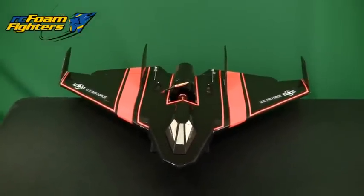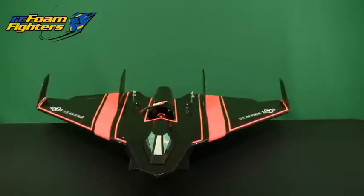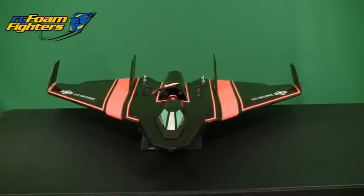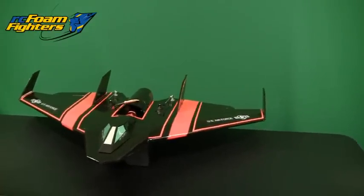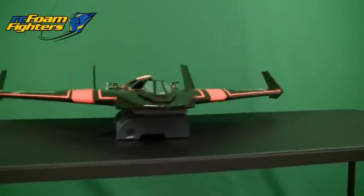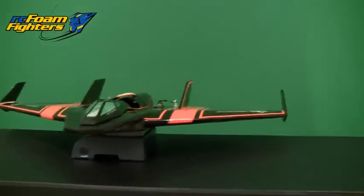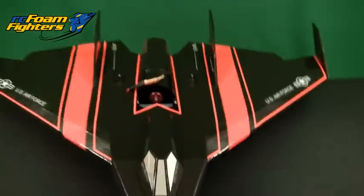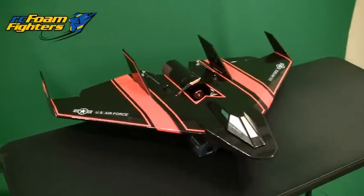Here's a look at the plane — I've got about 99% done. I've only got a few minor things to do: I just have to put the magnets on the canopy to hold it down. I may or may not put some landing gear on it, deciding on how I'm going to actually take off. I was actually pretty happy with the way it came out. I'm really happy with the way the wing and airfoil came out — it's got a nice shape to it, it's actually like a regular airfoil. I probably need to put one other bulkhead in the wing; it's not as rigid as I wanted, but we're going to try and run it and see what happens.